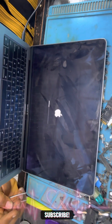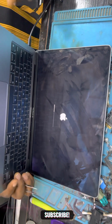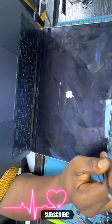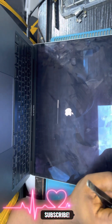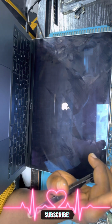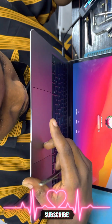The system is up. That's what we are talking about. HGS at it again. We solved the M1 chip. 5 volts stuck on M1 chip on a 2020 MacBook Air. As you can see, our technique works. Injection of power to bring down the particular chip that is faulty. Our trackpad is working. Our system is up.